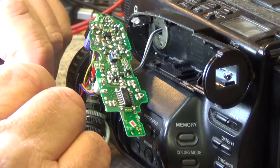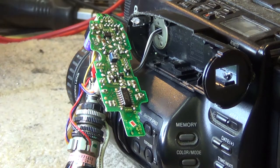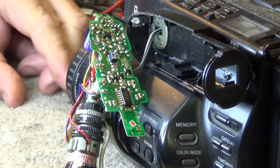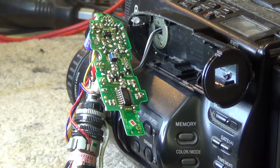I don't think I'm going to have an 82. In fact, I guarantee I'm not going to have an 82 microfarad capacitor. I'll see if I've got a 100. If I don't have a 100, I'll put a 47 in, but it might not give me full deflection. On 47, it might, but 100 should probably be enough. But let me go see what I can find.